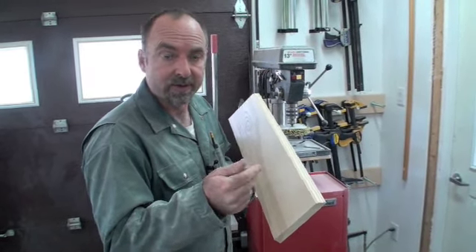Give it a second pass. You'd think with a treatment like this that it would really round over the profile, but as you can see it doesn't — the edges are still every bit as crisp as you want. They're not quite as sharp as before, but all the fuzzy fibers are gone. The surfaces have been sanded a little, so they're going to absorb stain nice and evenly, just like the face of the board. We've got what's pretty well a perfect profile.